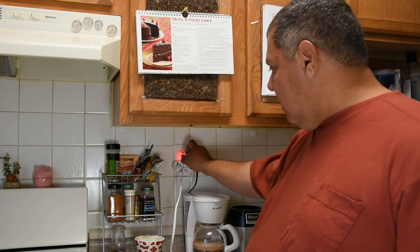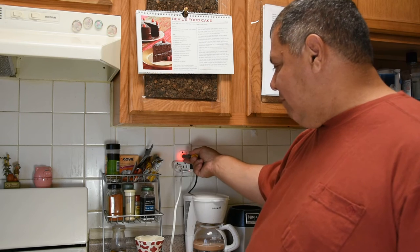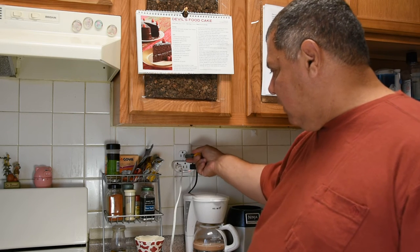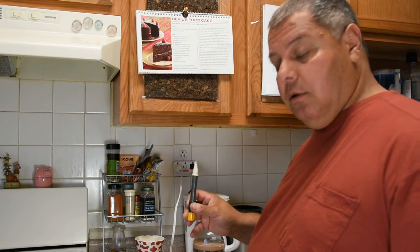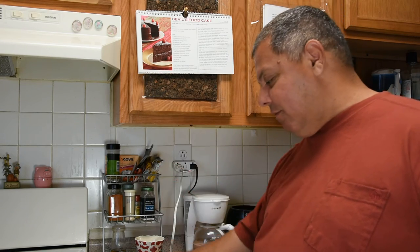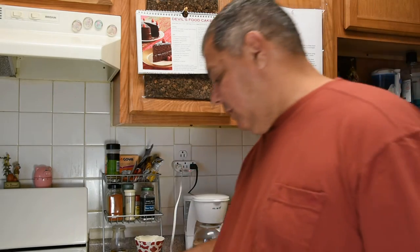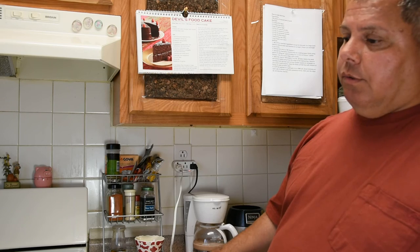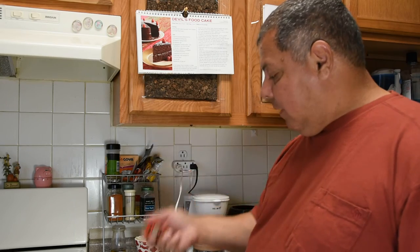These non-contact testers are nice, quick, and fast. Fluke will probably be more accurate than most. You can get basic non-contact testers for under $20; the Fluke will cost more, probably around $30. It's not my favorite tool. I use the plug-in outlet tester a lot — about 90% of my outlet testing is with that. It quickly tells me open ground, open neutral, reversed wiring. Then I go to the next outlet in series to find where the broken wire is and fix it.